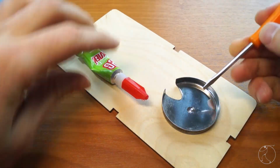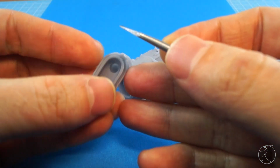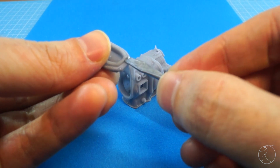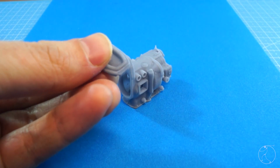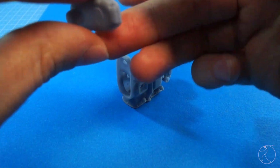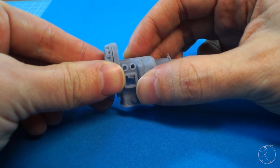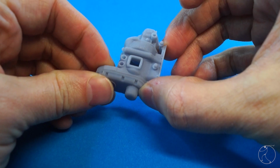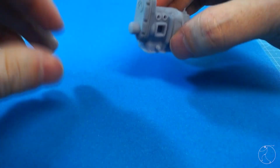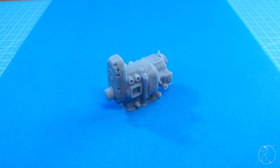Despite the fact that I made the standard distance in the grooves from 0.15 to 0.2 mm in all parts, they still differ after printing, plus or minus a few microns, and it depends on whether the part will easily fit in the groove or not. If you set the exposure time when printing to 2 seconds, then parts with such grooves will have to be filed. The only advantage in this is that we do not use glue. However, the details will gain in size and will not correspond to the digital model.